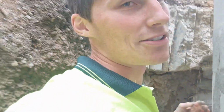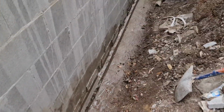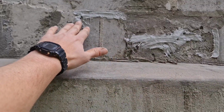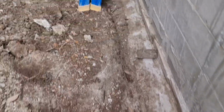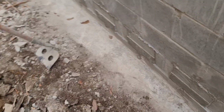We could have taken it to council, but it takes 4 weeks for the council to tie their shoelaces, so not worth it. On a good note, we are getting ready for waterproofing and we are finally beginning to whack some stuff on. We are filling little bits, odds and ends with silicone. All of our core filling's done. Everything's, gaps are filled in. We're cleaning down the bottoms to create a good seal and joint. We're going to try and get the waterproofing onto the footing as well.